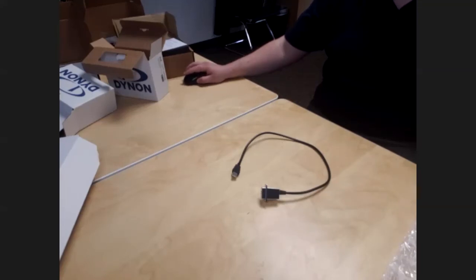You can get really, really tiny USB memory sticks, like the size of a chiclet, like a piece of gum, that barely stick out from the panel. So that's a real useful way to do it. If you have one display, buy two; if you have two displays, buy four, because then it lives in the display. And when, 28 days later, you get your new cycle, you download it to your computer at home, you bring it to the airplane, you swap it, you bring the other one home, and rinse, repeat.